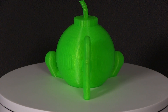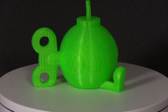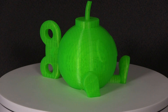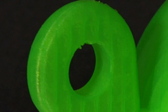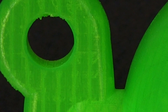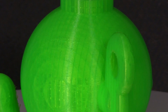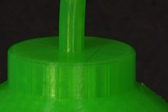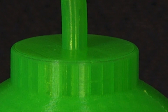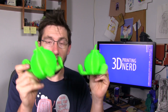I like this model because it's a sphere and it's got some sidewalls that I check for smoothness, and it's got this straw fuse thing at the top and some top layers. All in all, it's a great model. I can see that the Ultimaker missed on the overhang and the bridging just a little bit, but that could be an issue with the filament settings in Cura. The smoothness of this model is crazy — it feels smooth in my hand. Just in case it was a fluke, I printed another one and it looks exactly the same.